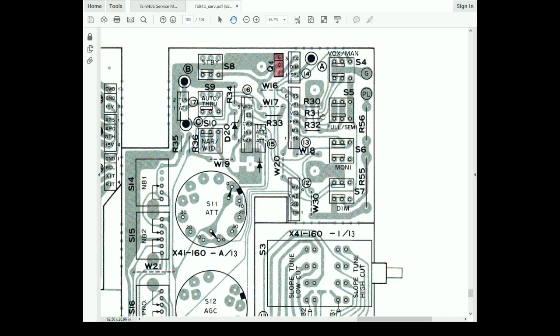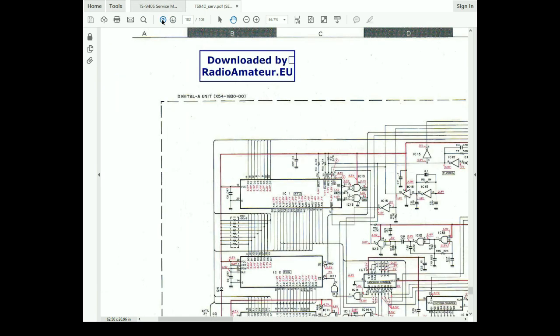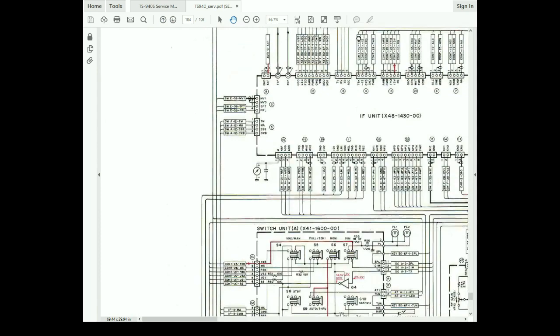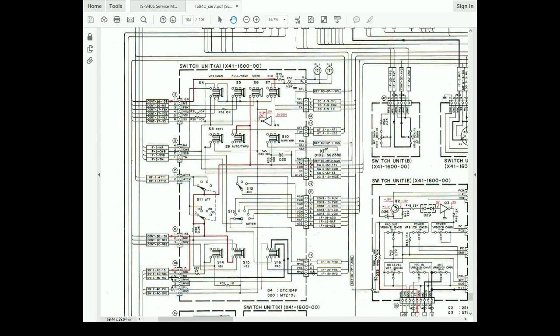So to make a long story short, the bottom line here is these two screws were loose. And the peculiar thing, and this is where, again, you can't trust service manuals 100%, the schematic showed you, wrong schematic, the schematic showed you all these grounds being continuous and contiguous. One single ground, everybody's happy, everybody's connected.